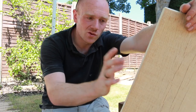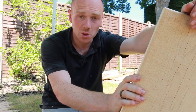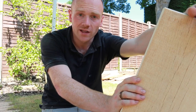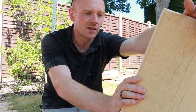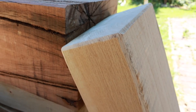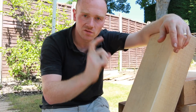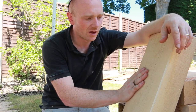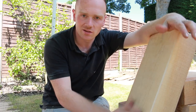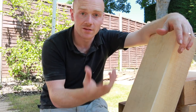Negatives: I mentioned weight. Machining them — cutting, sanding, planing, drilling — is probably about twice as hard as softwood; it's going to take twice the time. If you're using a circular saw, make sure you're doing smaller passes for any cuts, and things like machining the edges or drilling — just go slow and you'll get there.